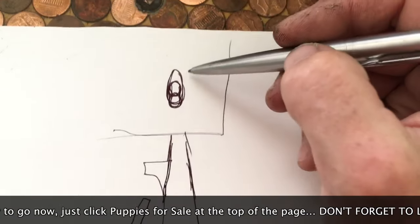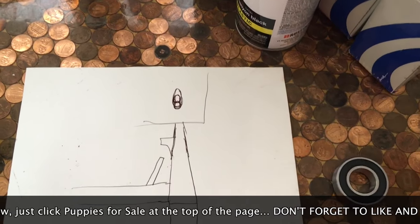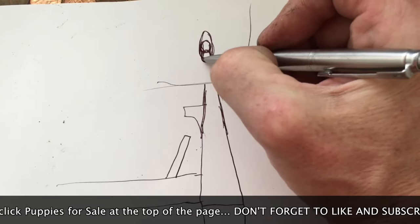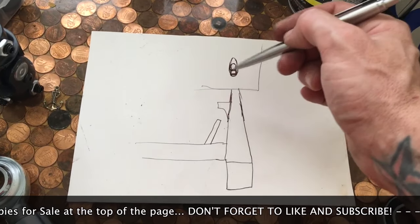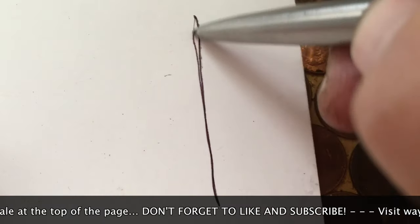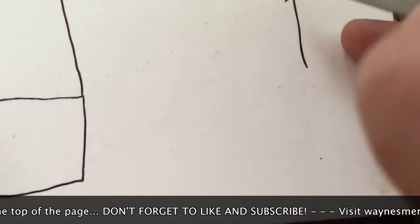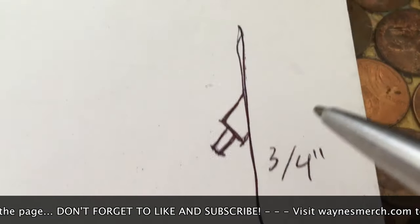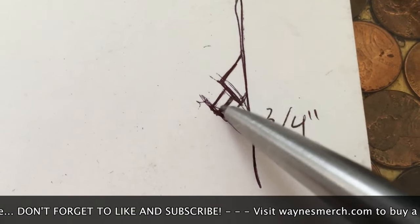What you want to do is get your steering column in the car and lined up with your seat the way you want it — close enough to be comfortable but far enough away to get in and out without trouble. Mark your steering column where it's coming through the firewall, then pull the shaft down and cut off where your line is, or pull it all the way out and cut it — whichever is easier. You'll end up with the firewall ending here and just a little bit of that shaft sticking out. If you want to retain the shifter, cut the sleeve right here, leaving the shaft sticking out a little bit.